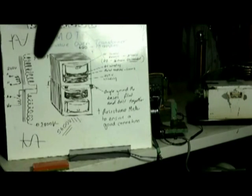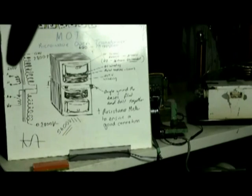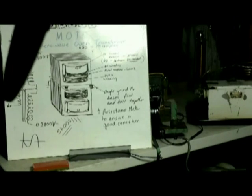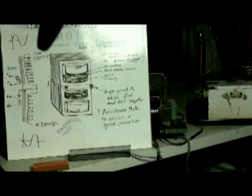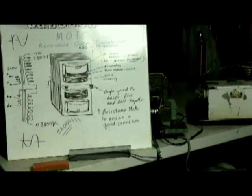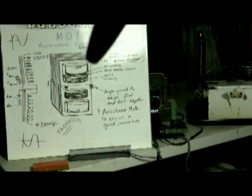The cores are now connected together, and so are the coils. We have the 240V — as we said before, they are polarized — you just reverse the winding so that you get a 180-degree out-of-phase effect. So when this one is at 2800 volts, the other one will be at minus 2800 volts — the exact opposite. That way they will spark and jump into each other and you will end up with a combined voltage of 5600 volts terminal to terminal, operating like a single 5600-volt transformer.